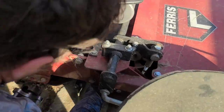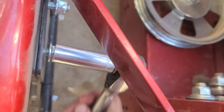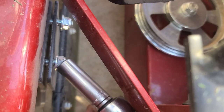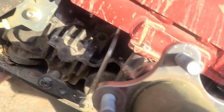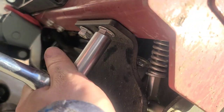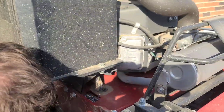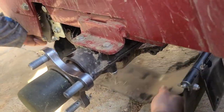You got two bolts right here in the front — you might be able to see it better on the top. This is the brush guard for the hydraulic transmissions. It protects it from when you're out cutting so you don't smack it against stuff. Right here you got two bolts on the back side. It's gonna drop down and release. You can do it without taking those off, but you're gonna have an oily mess. So let's just get that off and drop it out of the way.